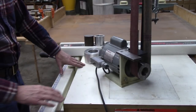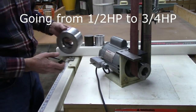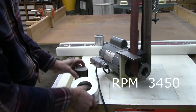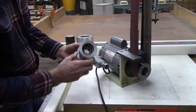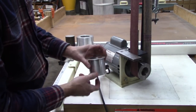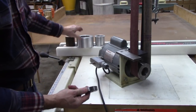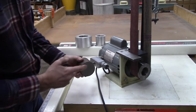Okay, what I'm going to do is use a larger motor, and I'm going to increase the lower pulley size to this diameter. I've got to sleeve this piece of aluminum I got. This is meant to hold bearings. I've got a pulley for the upper idler. I'm going to cut the flanges off it, and it's already got bearings, so that'll be pretty easy. It's even crowned. These are surplus from the printing industry. I've got a bearing that fits in here, so I can get an idea of measuring that diameter and what I got to turn that down to.